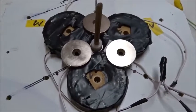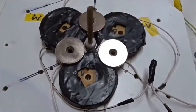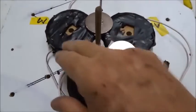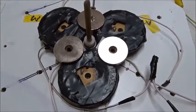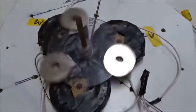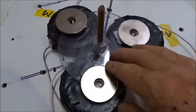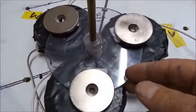Incidentally, when you see those alien symbols — like on Project Blue Book — a series of rings with other rings between them: that's what these things mean. You've got three coils and three magnets, and it's three-phase power. If you put three magnets directly over three coils and turn on three-phase power, they just rattle up and down — U, V, W — bouncing over each coil in sequence because U, V, and W fire at slightly different times, so you get no torque.